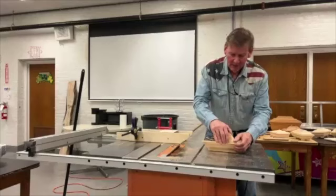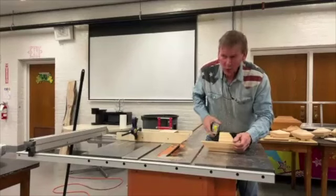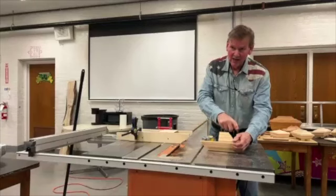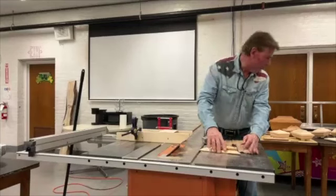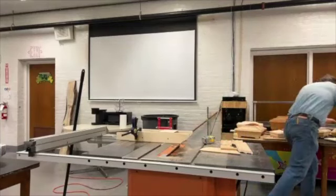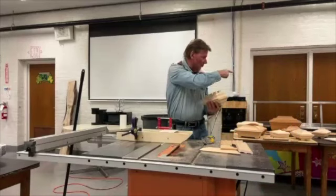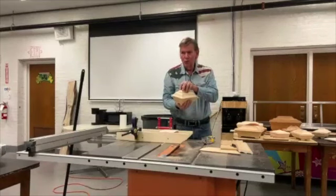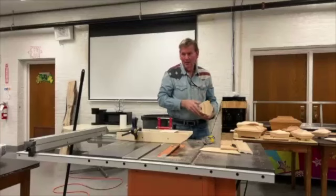Put your piece in place. Again, we're about 2.5 inches. So you know that if these were to touch in the middle, we'd have a 5-inch side. And five inches is about as small as you want to go, because once you get smaller than 5 inches, this one is 5 inches, you end up with a very small piece when you're cutting the top. There's very little sitting on the fence. So 5 inches leaves you enough to sit on the fence, but any smaller than this, it would come almost to a point, and you'd have to put a sacrificial fence behind this fence to support it.